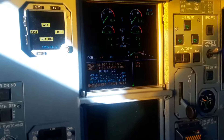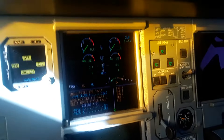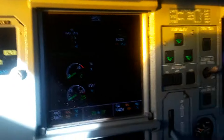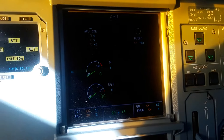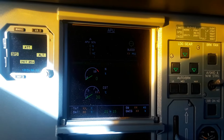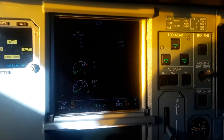If I remember correctly, I do believe all three of these batteries are paralleled. The first screen is up — don't worry about those messages. Press and hold APU. If you let go, you just have to go back to that screen, so you have to press and hold. Come over here, just like on the A320, push the master switch, press and hold, and wait for it to say 'flap open' — that means the inlet air valve is completely open and it's ready to go.